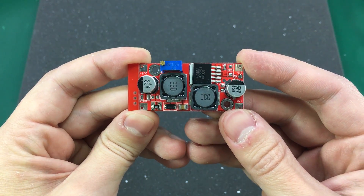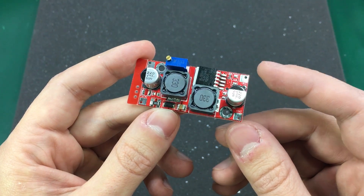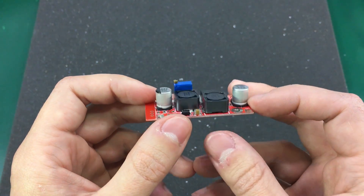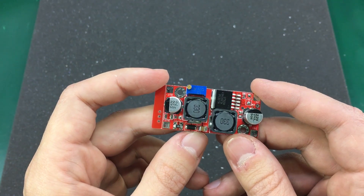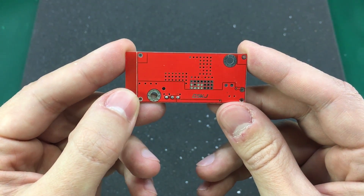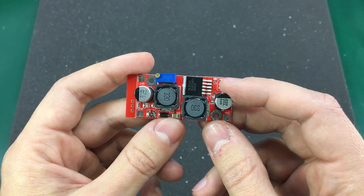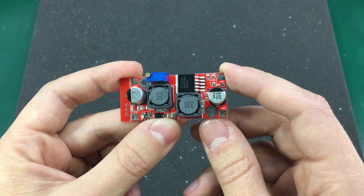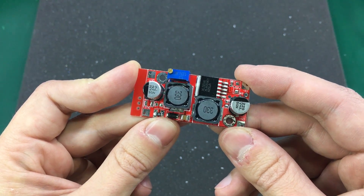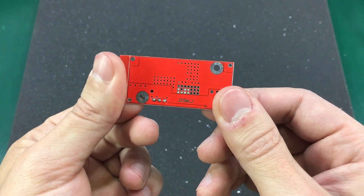Our next item is another DC to DC module, but this time a buck-boost module based on the XL6009. Because it's a buck-boost module, it can step down and also step up the input voltage according to our needs. This can be extremely helpful in scenarios where your input comes from something like a photovoltaic panel which outputs different voltages depending on sunlight. You could use a module like this to get a regulated 12V output from an input swinging from let's say 5 up to 32V. Of course the efficiency will vary across the whole range, but at the output you will always get 12V. Links will be in the description.